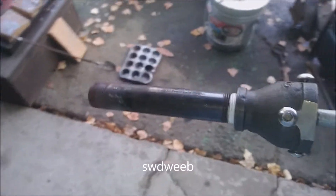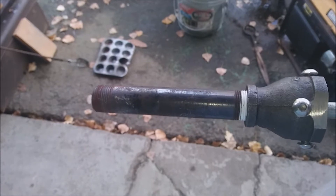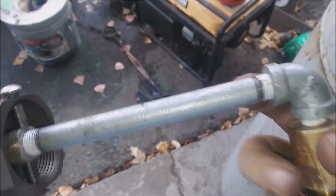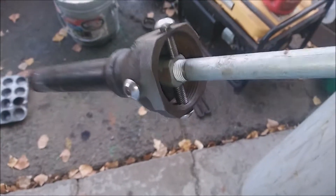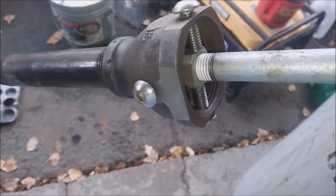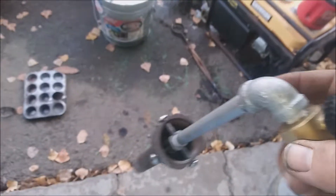My fellow YouTuber's burner is just not working efficiently enough to heat up. What I've got here is a three-quarter black iron pipe, six inches long, with a three-quarter to one-and-a-half inch bell reducer, a quarter-inch galvanized six-inch national pipe thread pipe, a quarter-inch female-to-female coupler, and then a brass quarter-inch plug with a 57 drill bit drilled through it. This thing rocks.